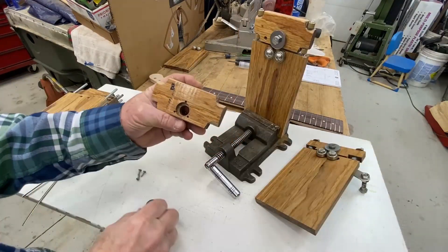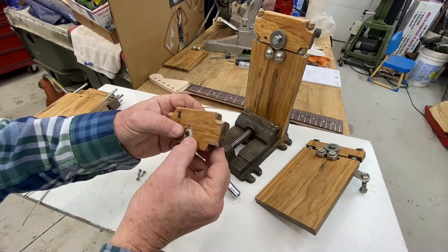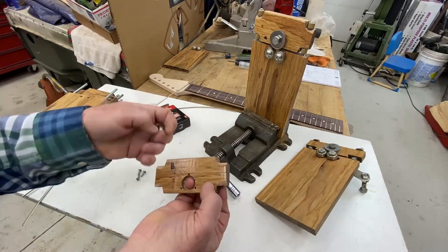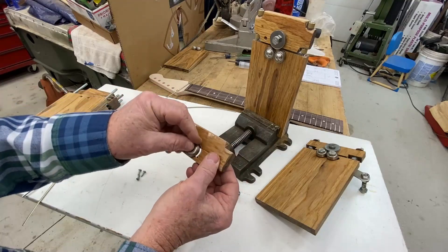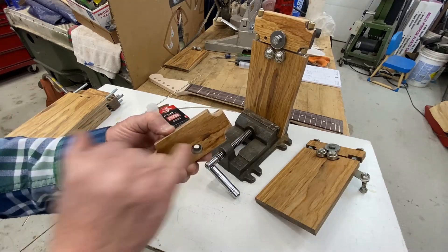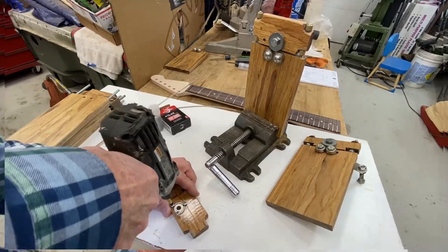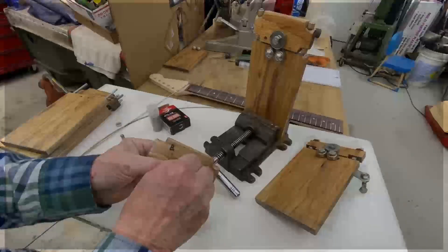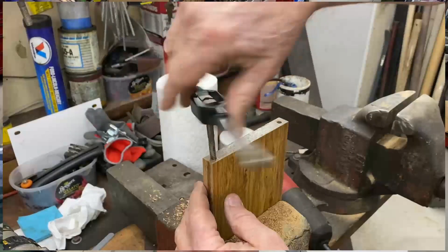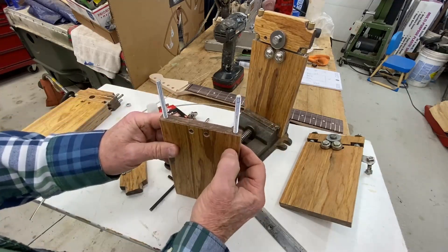On the top half here, you have a 7 eighths hole that this bearing will fit into, drilled deep enough to accept the bearing. And a 5 eighths hole on the front for the spacer that needs to go in here. Now, three little screws that don't go all the way through hold that bearing in place. On the bottom half, using this guide to drill the holes, I've drilled and tapped inch-deep holes for quarter inch rod.